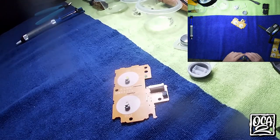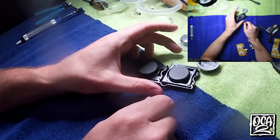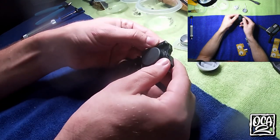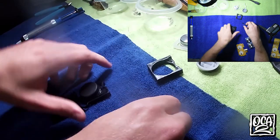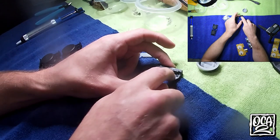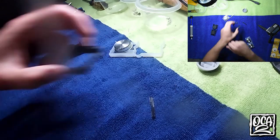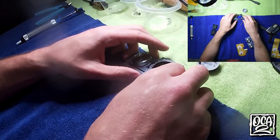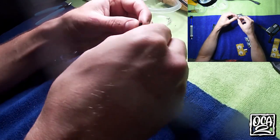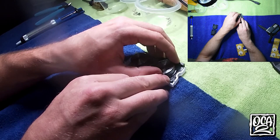So this button frame that I've built here minimizes that range of motion. It still allows your normal movement but prevents it from going further down. It does give you a little bit of a dead zone at the top, but we know that's what's causing the problem — I'd rather have that than have my button failing. It locks your button in and keeps it from wiggling around.